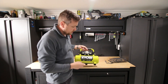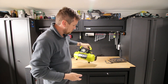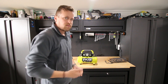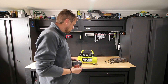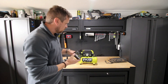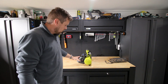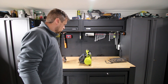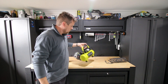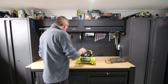This little thing has a 3.8-litre tank. It's heavy — 6.4 kilograms, so closer to 7 kilograms with a 6 amp-hour battery. You can use it with a smaller battery but I wouldn't recommend anything below 4 or 5 amp-hour. 6 is preferable; if you've got a 9 amp-hour, you can use that too. The 4 and 5 amp-hour batteries are pretty much the same size — just different capacity. The 9 amp-hour is quite bulky and when you lift the unit it pulls to that side, so it's quite heavy with it.